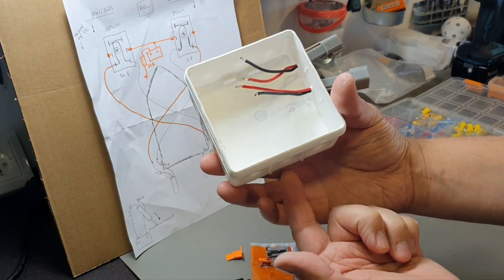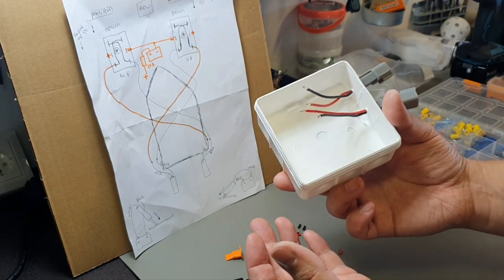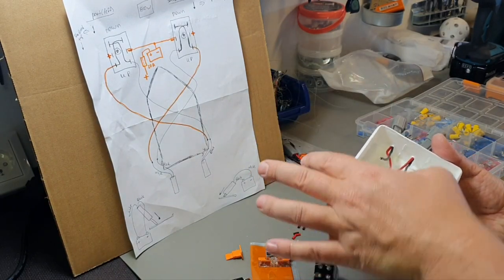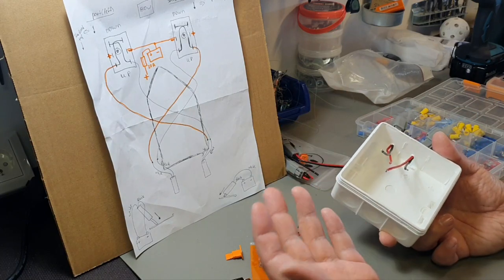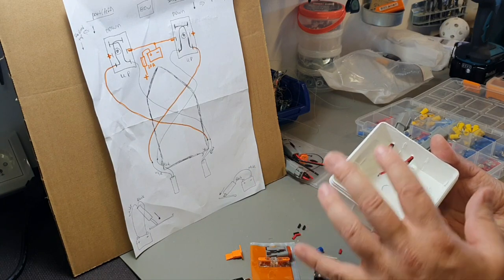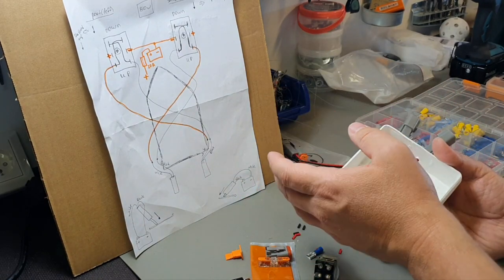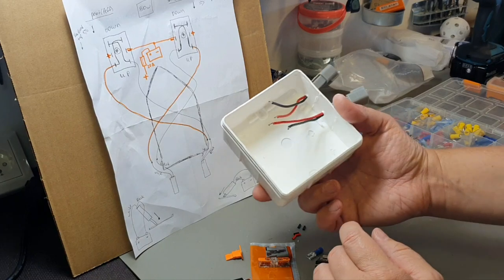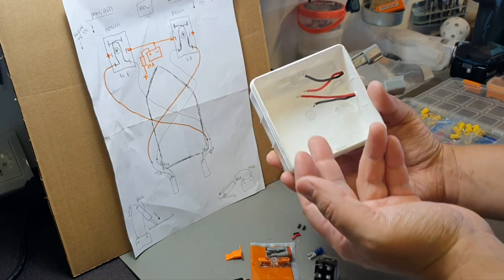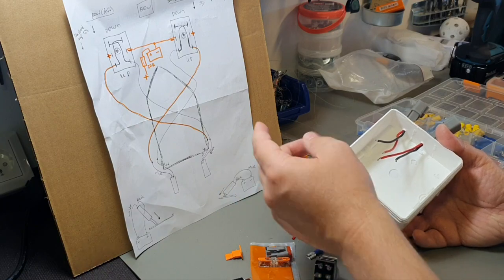Yeah, you will also need to provide plus and minus somewhere here, and where you take it from, directly from the battery, probably from somewhere in the panel. We tested consumption. We have seen 2 amperes. But this is normal consumption, and I know that motors have inrush current, but inrush is a short current. The cables will manage. Probably it's okay to take it from some place on your dashboard. But anyway, you should provide here also 12 volts, or 24, maybe in your case.